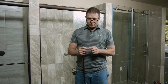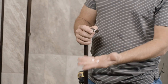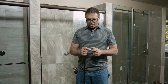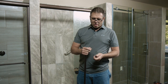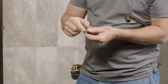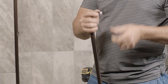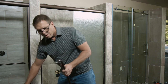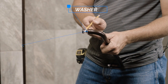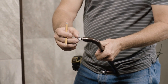Our next step is to install the towel bars. The towel bars come equipped with a 3/8 inch spacer for heavy glass. They're going to give you smaller spacers for a quarter inch glass, which is what we're going to have on here. So take it apart — you're going to notice that we have washers and a grommet. You're going to have your towel bar, your washer, your grommet or spacer, then another washer, and then your end piece.